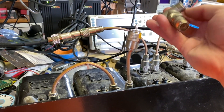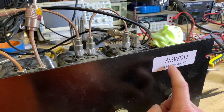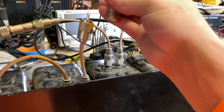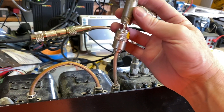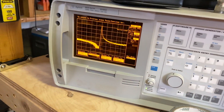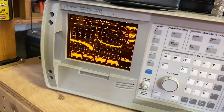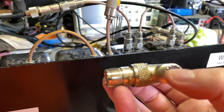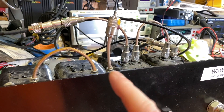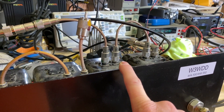It also blocks everything surrounding, and blocks output from itself. When you do this, you're counting on blocking your own transmit signal — we're transmitting at 444.550 and you don't want a lot of that going directly into the receive side, otherwise you'll damage the receiver. That's why you need to be careful. Ideally, 30 dB is probably the minimum isolation — a lot of higher-end duplexers can get much more than 30 dB. Anyway, hope this helps. Be sure to like and subscribe — we'll see you on the next one!